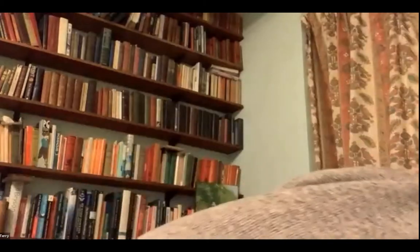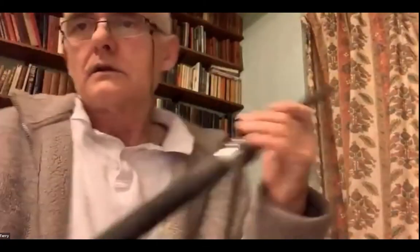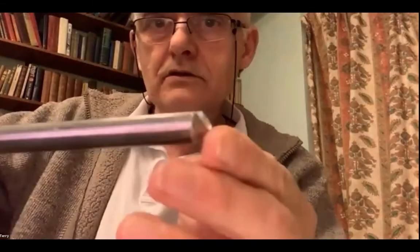But a traditional grind, like that one, well, there, that's ground with much less of a sweep angle, sometimes even straight across, like 90 degrees, like a spindle roughing gouge. And a much more obtuse bevel angle, so compared to the other end, which is a bit more sweep and a keener angle, this is better for going across the inside bottom of a bowl.